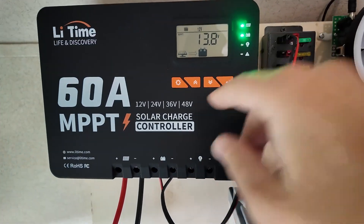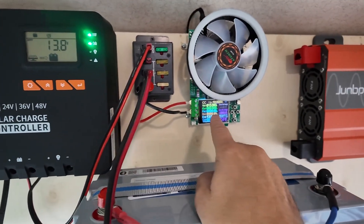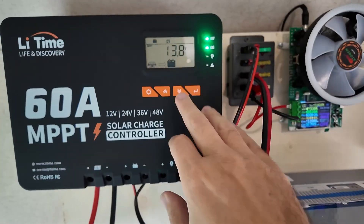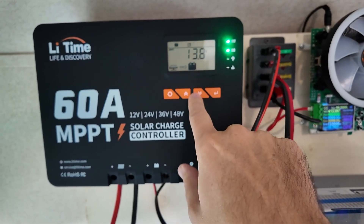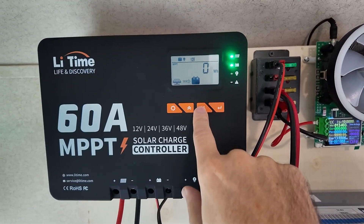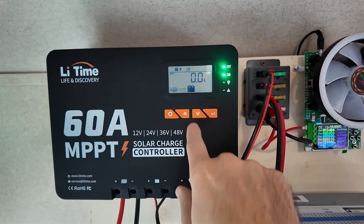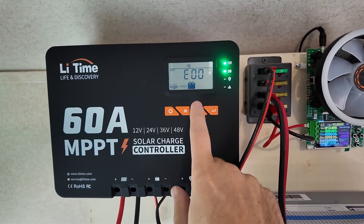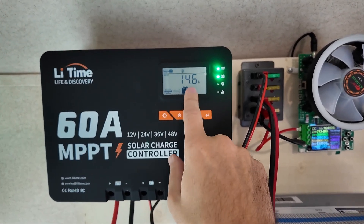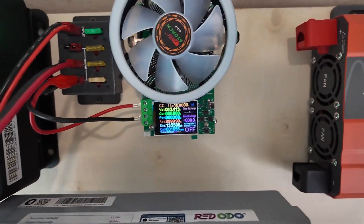You can never have two meters that 100% agree without full calibration, and you saw there was a calibration circuit in there. So we're taking from the solar panel to the battery — 13.8 volts. From the solar panel itself we're getting 28.6, so we've got decent sun. We're doing zero watt hours to the load, zero amps from the battery to the load. The battery's charging. E00 means no error. 78 degrees in here. Five watt hours into the battery so far — my solar panels are shoving 14.6 amps into the battery right now.